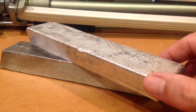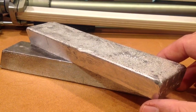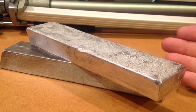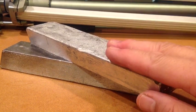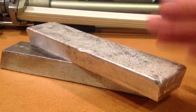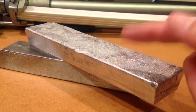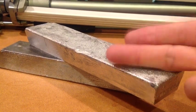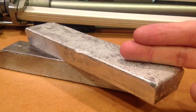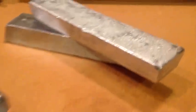If you want to see that, you could melt some dirty lead and, instead of cleaning and skimming it like we normally do, just cast it dirt and all into an ingot mold — and you'd get a dirty ingot. You could tell the difference. It's very difficult to have a bar with 30% slag and dirt and have it come out looking clean like this. As experienced casters, we know what a dirty bar looks like. Roto-Metals cast their bars clean like our ingots.